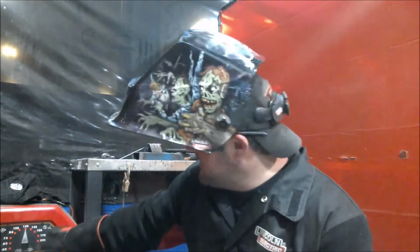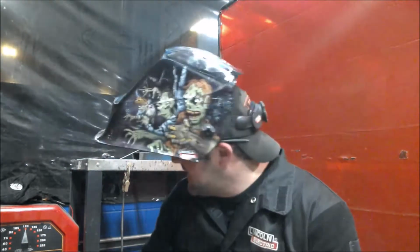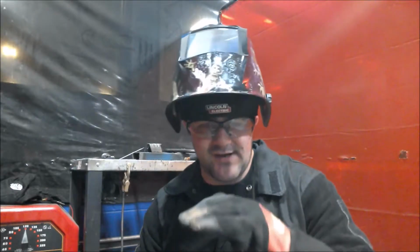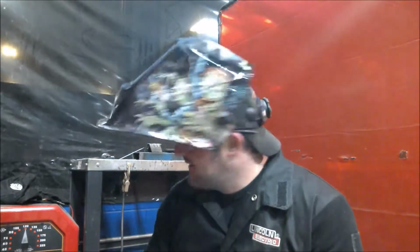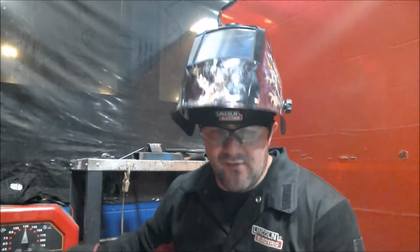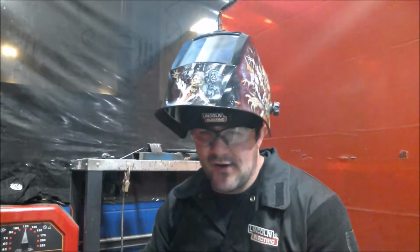What I just changed right here is the amperage setting. So I'm going to be going 120. That is the recommended setting on the 6013 that I'm going to be using. They have charts and stuff like that you can read. The 6013 is a 1/8 diameter. So that's what is recommended. 120, between 120 and like 135, right?